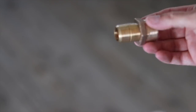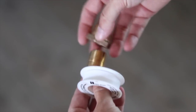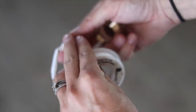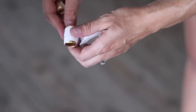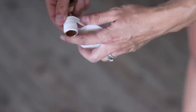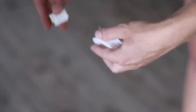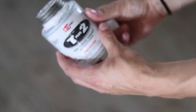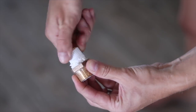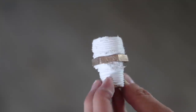This is the fitting I needed to purchase in order to make my Aquor system work with my existing piping. You can see it's just two male ends that screw into the faucet and then into the female end that's already down there. You can install an Aquor faucet leading up to PEX or copper piping like I have, or multiple different plumbing scenarios — there are installation instructions to make any of them work. You can see that I'm coating the threads in plumber's tape and then also putting on some plumber's putty thread sealant. This is going to make sure that my threads hold tight and that everything is totally waterproof with no leaking.